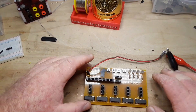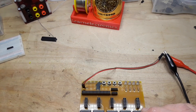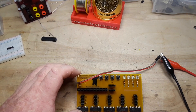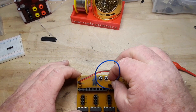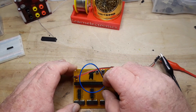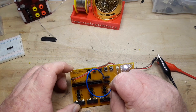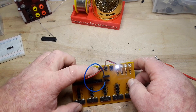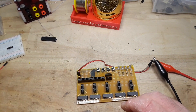Just powering it from my bench power supply. You can see we have all of these LEDs here and they all go to this jumper marked LEDs one, two, three, four. If I plug in there, the keys are high, so you can see the LED lights — there's LED one, two, three, and four. The buttons bring it low.